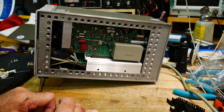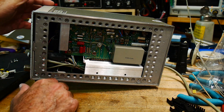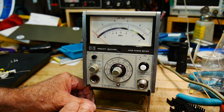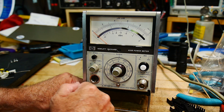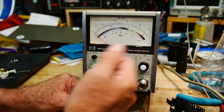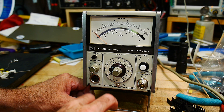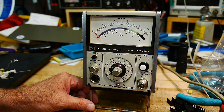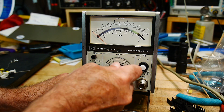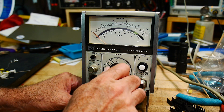I was poking around in here and you can get a schematic for this thing. The way it works is it measures very, very small voltages — these are very sensitive devices. It does a chopper-stabilized amplifier with synchronous detection. It chops the signal at 200 hertz, then sends it through AC amplifiers, and at the very end changes it to DC to put it on the meter. It has some really nice filtering — a two-stage RC, probably a Butterworth filter for maximum flatness. It switches in two different size capacitors, so it has a very fast or a very slow response time. It goes all the way down to 3 microwatts of power.